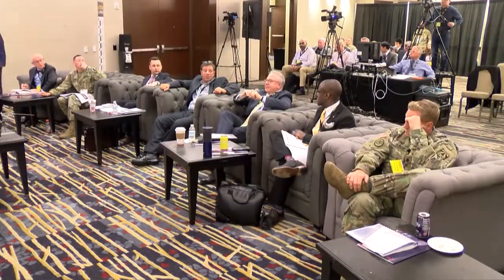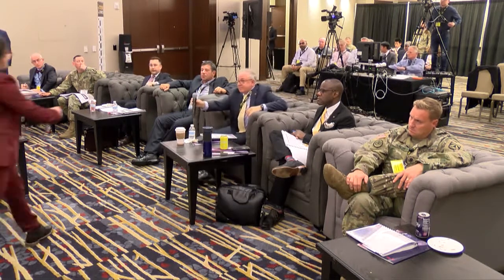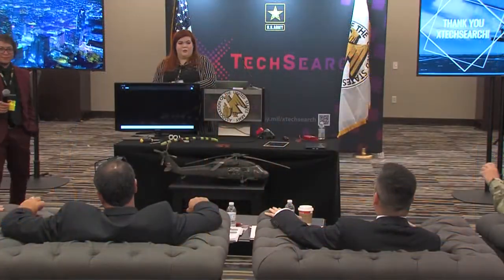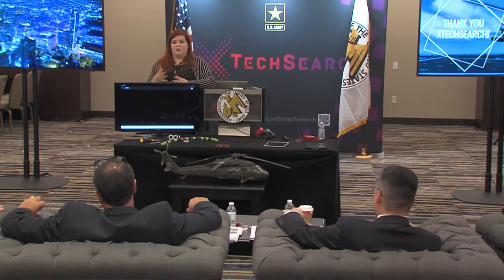Can you talk a little more about the sensor technology and any issues with the aircraft with all these emitting sensors? We are currently doing commercialization with the AFRL, the Air Force Research Lab. We are licensing their technology to be able to isolate a single faulty wire. The technology is proprietary, but we're happy to discuss it after the presentation. These sensors harvest energy from the vibration of the aircraft to communicate, so they're wireless and don't require any battery. It works on an ask-and-receive basis, so you ask for it and it sends the information, differentiating between each sensor so we don't interrupt anything.